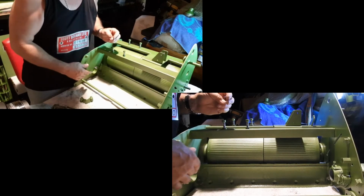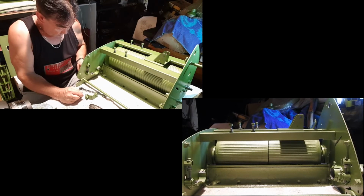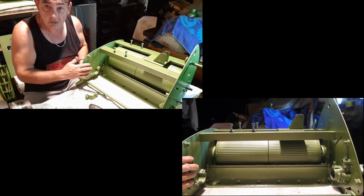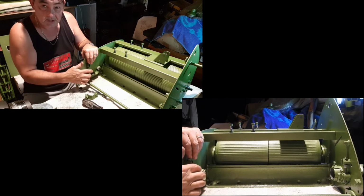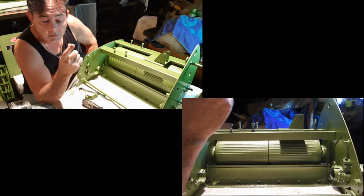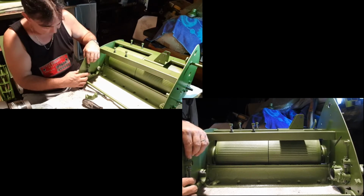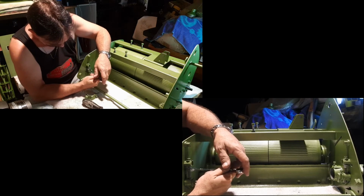That makes more sense. And I'm just going to do the same on the other side. Okay, whenever you are touching these bearing holders at the front, you always want to be undoing these nuts at the back, because if you don't, then you're going to probably break your bearing holder, do some sort of damage. Without undoing those, that adjustment's not really advisable. Little tip here is don't wind this down into your pivot bolt very far, just a little bit, because that way when you are screwing this down, you can have your wrench or your spanner on your nut.